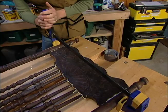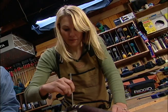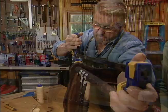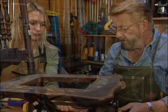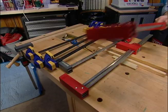You always like to glue it back together before you strip it. A couple of reasons: first, we've got all our labels on here. If we stripped it, we'd have to take those off and put them back on in the right spot. But also, when we glued up, some of the glue squeezes out onto the surface, and it's easy to clean that glue off while the old finish is on here. Obviously it can take a lot of clamps.